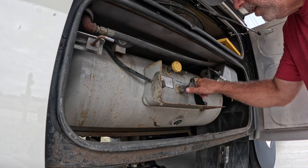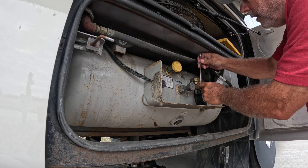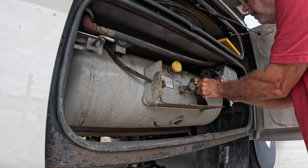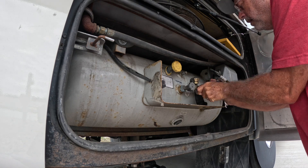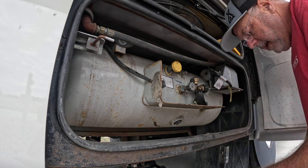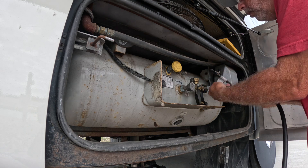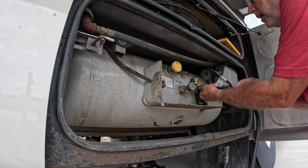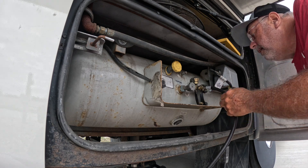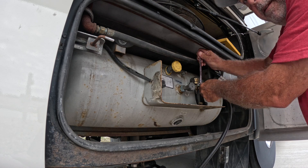First, make sure the propane is turned off. There's a nut right here that is 7/16. You'll hear some gas escaping from the propane system — it's not coming from the bottle. Take that off, then take the hose. You cannot hook the hose up while it is connected to the bottle because this is a secure fitting and it does not turn. So install the hose here first.